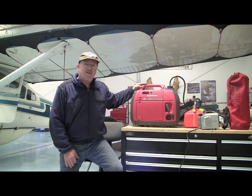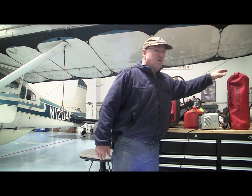To recap, phase one, you've got to keep the snow and ice and frost off your airplane. Have a good cover system. At the very minimum, wing covers, tail cover, engine cover. Preheating the airplane or keeping your engine warm. Find a system that works for you. Be careful. Some of the systems could burn your airplane up. I have found a good system that works for me with the Honda generator or any small portable generator, but I use the Honda generator. I've mitigated the breather freezing problems and the auxiliary fuel tank, so that's pretty easy. And I've got my standby heat source, my Northern Companion, very reliable with the MSR stove.